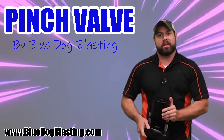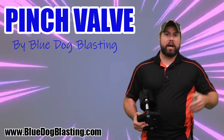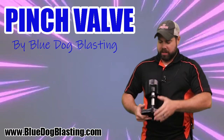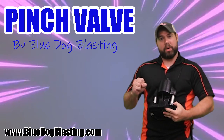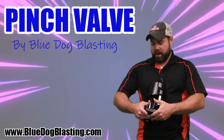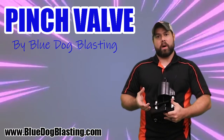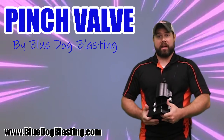So this thing is pretty simple to use. You'll find these instead of using a combination valve or an inlet-outlet valve. It is NPT thread up on top so your air in goes in. It is a naturally closed system, so once air goes to it, it will shut down. It pinches that hose so abrasive and air cannot go through out to your blaster, and once you hit your Deadman, it releases the air pressure, which then springs this up. Your hose widens up and opens up. All your abrasive and air goes through and you just start blasting on the other side.